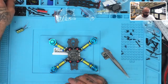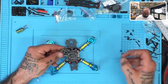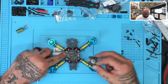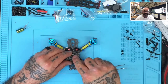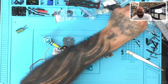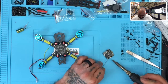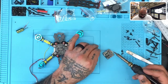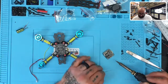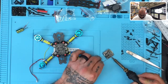We need to run some cables, so I'm going to grab some wires. First, I'll figure out the layout — this board is going to lay like this. I need to get from the telemetry RX6 to TX on the flight controller. I'll also need to get to the TX6 for our smart audio. Let's go ahead and get started. I'm going to tin the board up and set up RX and TX6. I have current sensor and RSSI on this side — not worried about those right now. I have UART 3 RX and TX3 as well — not using those just yet, but I'll tin them just in case.